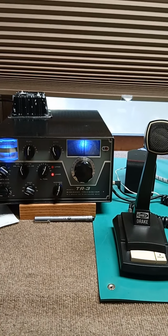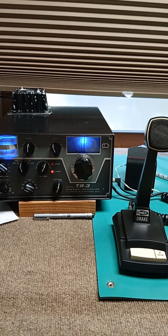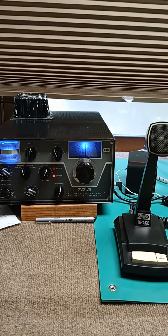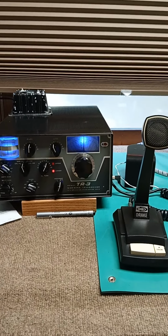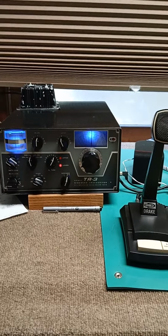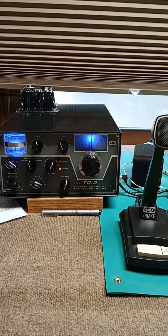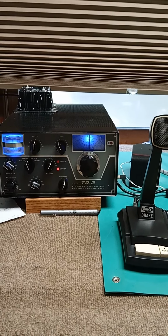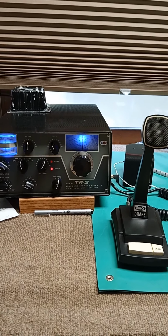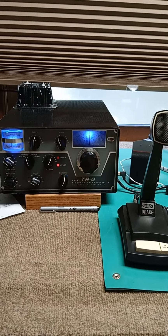As I suspected, it was necessary to adjust the balance modulator transformer to null the carrier out. If it's off frequency, it'll be reactive. But there was still a considerable amount of stray carrier, so I had to reverse the phase on the balance modulator transformer. If you'll see the power supply video I did, I talk about transformer phasing and about RF transformers having polarity. And that was much of the problem.